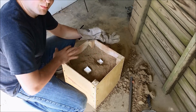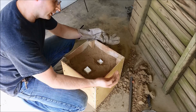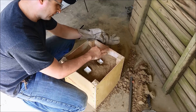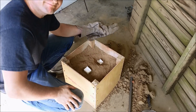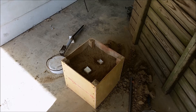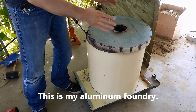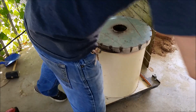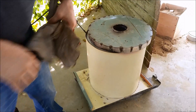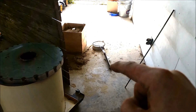It's all buried now. The aluminum will get poured into that hole there, fill up, and then start to come out this hole here. The next step is to pour it in. The aluminum is inside there melting inside of a crucible, and when it's melted to the right temperature we'll pull it out with the tongs and set it on that concrete pedestal over there. We'll pour it into the mold which is sitting over there. I have a shield up against the wind because it's just too darn windy today.